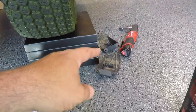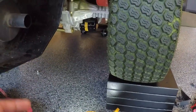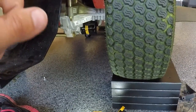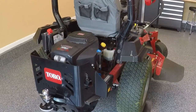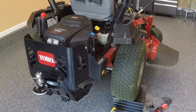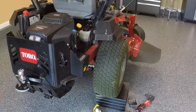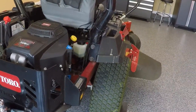I'll leave the filter guards off when getting all the air out of the system, just to make sure there are no leaks from the oil filters themselves. Once that's done, I'll go ahead and put the guards on. I'm almost done with this gallon — that should bring it up to pretty close to where it needs to be, and I'll finish filling with the single quart I have. Got everything buttoned back up. Those two top port plugs, you torque to 15 foot-pounds, so don't go crazy. The right side transmission fills up a lot quicker than the left side, so just be aware of that. When it's full, it starts coming out pretty quick, so make sure you have a pan underneath.